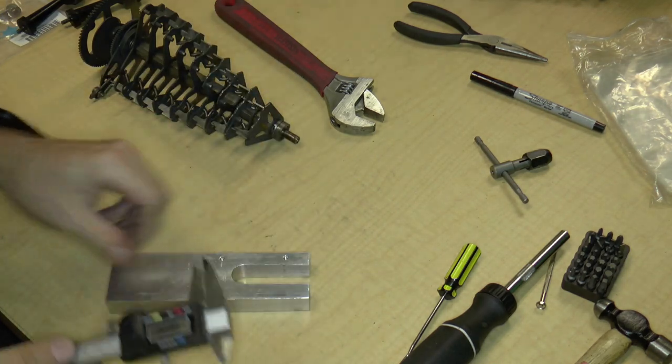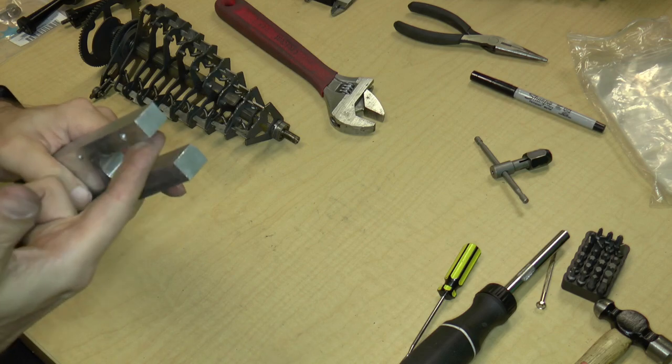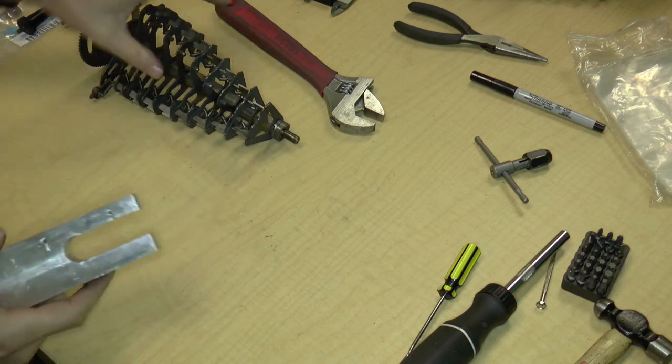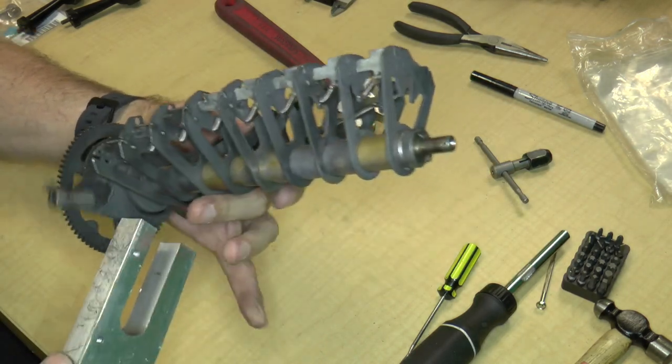How big is this, you may ask? Well, this round stuff here measures out to about 0.696 or so, and I made this 0.75 — three quarters of an inch. Actually it's slightly bigger than three quarters of an inch because I went and smoothed the inside, so it fits loosely, which is good.